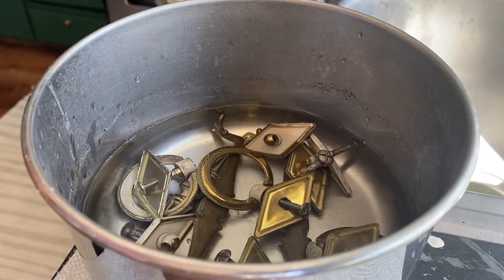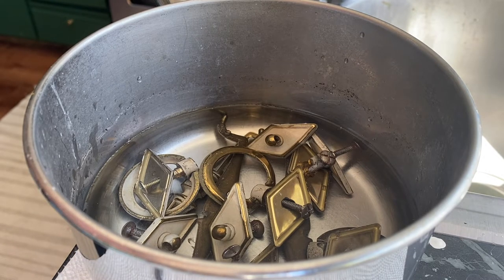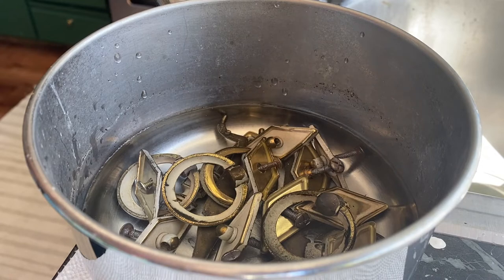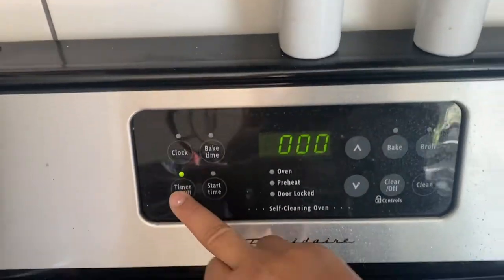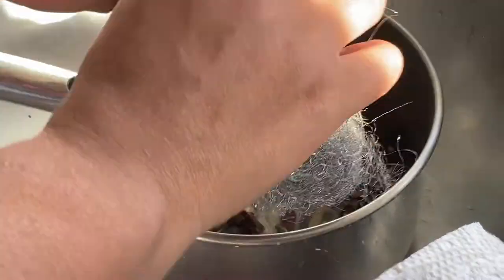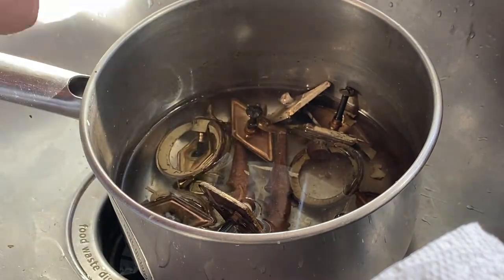So this is actually another one of my favorite parts of furniture flipping, cleaning the hardware. I actually love any part of furniture flipping, but there's something about putting the hardware in that water and white vinegar and boiling it and seeing the paint peeling off that just gives me goosebumps, guys. I love it, and I love cleaning it off and seeing the little diamonds in the rough come to life.